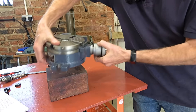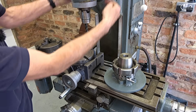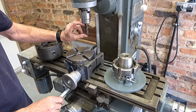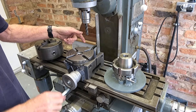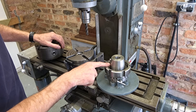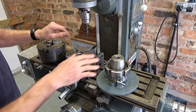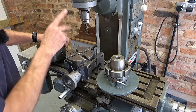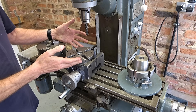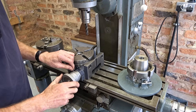Let's put it on the mill and see what it looks like for size. When you've only got a small mill, height is quite important. Because of this kind of gooseneck on this head, this mill's got quite a bit of height, but this table is right down to the bottom at the moment. I've put in a fairly long cutter in a Clarkson holder, which is quite long as well. With the table right down, you can see I've only got that much left. I made a sort of rotary stand for myself with an L00 fitting, which means I can take chucks from the lathe and drop them straight on — but straight away you see the problem: I've run out of height. It's great on my big pillar drill, but not on this mill. So this rotary table is quite low profile, which is useful. It's 150 millimetres, not six inches, so it's slightly under six inches, but the profile is quite good — not too high.